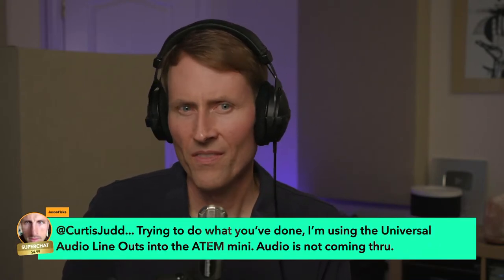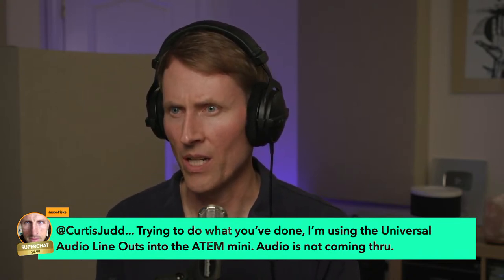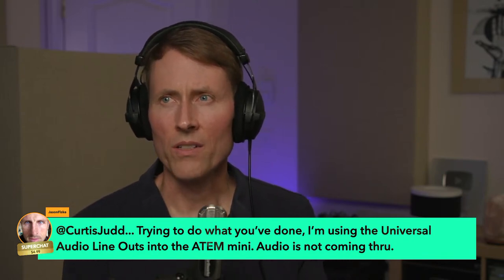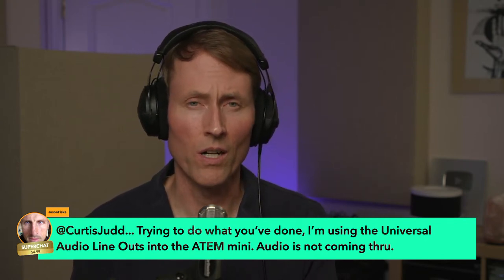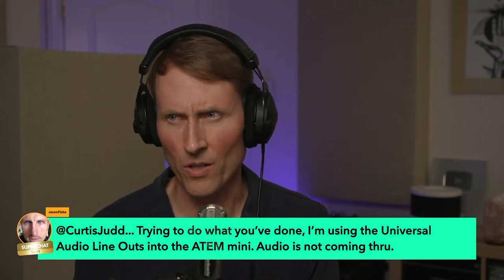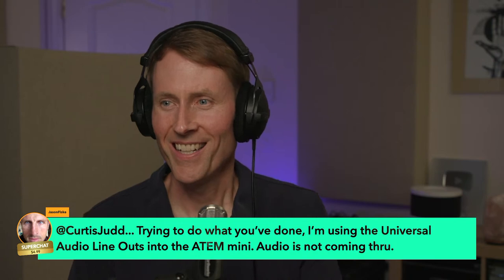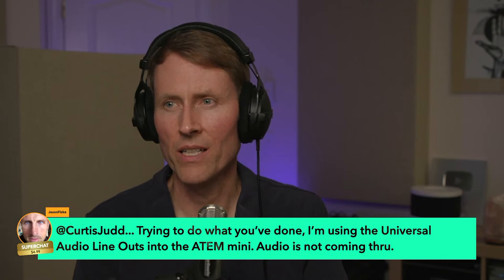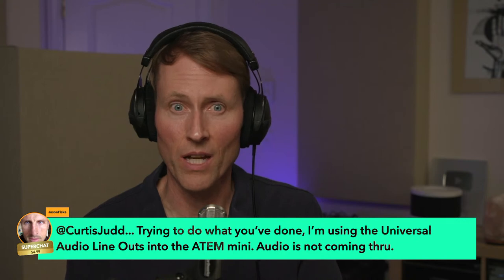From Jason: I'm trying to do what you've done. I'm using the Universal Audio line outs into the ATEM Mini. Audio is not coming through. Okay, Jason, the trick with the Universal Audio is that you have to use the Universal Audio Console app. In the console app, you have to tell the Apollo, I'm assuming you're using an Apollo. I think they're all Apollo, Universal Audio interfaces. Anyway, you have to set up the console app so that it will send audio, and tell it what you want to send via the line outputs.